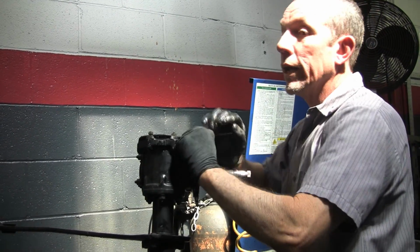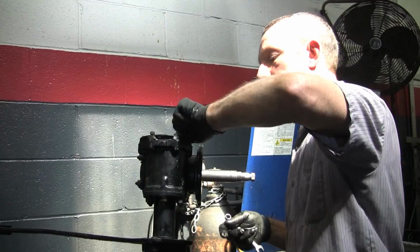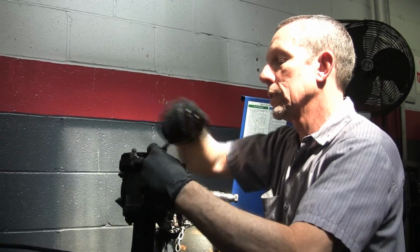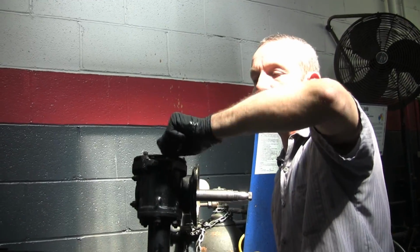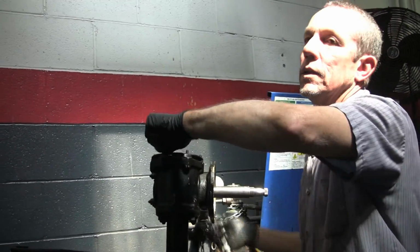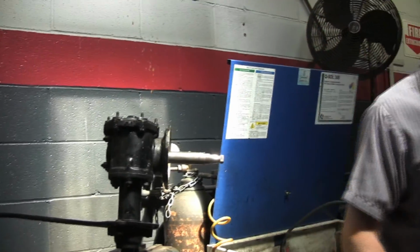The Silver Cloud 1 has a totally different steering box. It still has this, but it doesn't have the transfer gear or this big arm. It bolts right in between some braces, because it didn't have a big old honking V8 engine to work around. They just squeeze them in. They could have done it with universal shafts and universal joints, but that's tacky. It's not Rolls-Royce. That's hot rod stuff. Why use UJs when you can use precision cut gears?